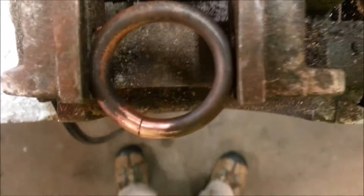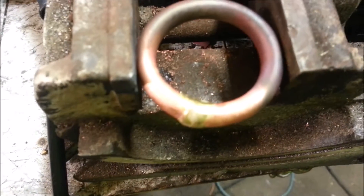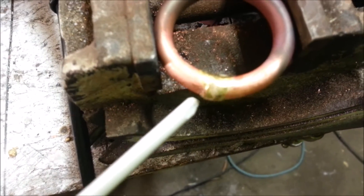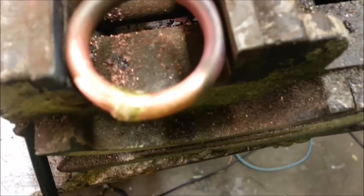I'm getting ready to braze that together. Hopefully that gap's not too big — it's a lot bigger than I'd like it to be, but I think I can pull it off okay. I have to braze this because of the high temperatures it's going to be exposed to. Just wanted to share a quick tip I've found very useful when brazing: if you feel like you've got too big of a blob in a certain area and you want to remove that blob, I'll just take my rod and bring it over, get some flux in that area, and then bring the heat in that direction.